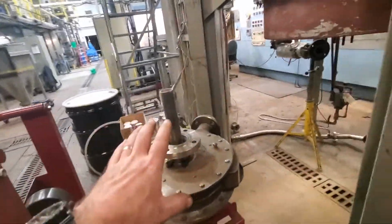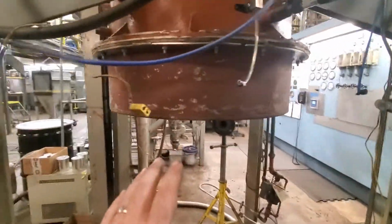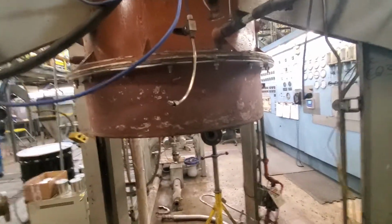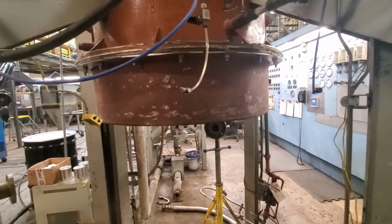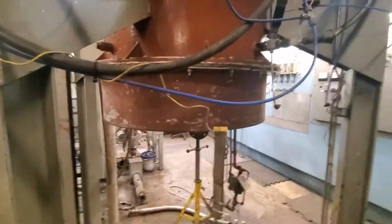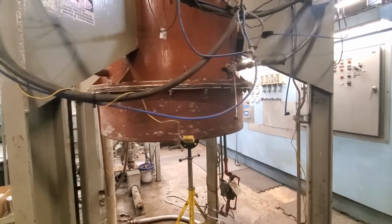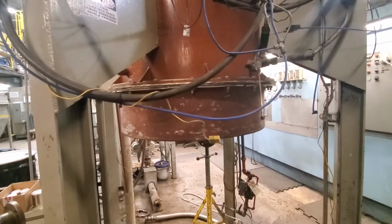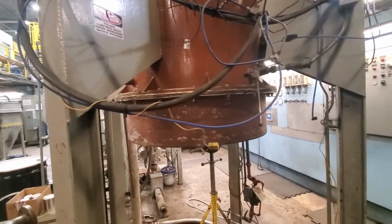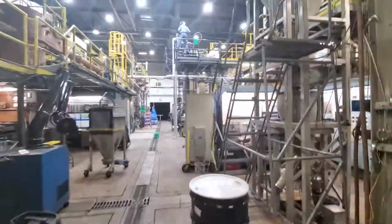So the next step is going to be to put the furnace back together once the top is cleaned out. You want to be pretty quick about it. Get this burner back in there and stop that convective heat loss, with that open port in the bottom of the furnace. We have been offline for about an hour and a half to 2 hours typically while we're doing the maintenance. About 2 in the morning we go on gas, and then about 3 in the morning we go on coal. At about 4 o'clock we're all lined out, everything's ready to go, and we bring the carbon capture skid back online. So that's an idea of the timeline of all of this and what's going on.